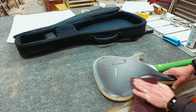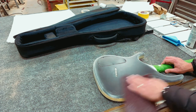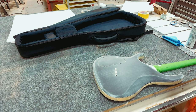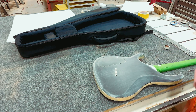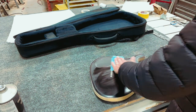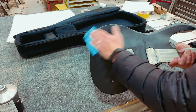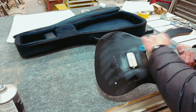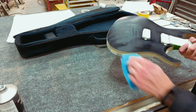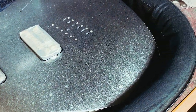I'm just using the red one here to get this abraded. You can use sandpaper as well — I'd opt for around 600 grit before normal painting, 400 or 320 before a typical primer, a little heavier on bare wood. If you're moving to just a thin coat with clear coat, I usually go for around 800 grit. After abrading I move on to cleaning. Part of why I like those scotch pads is they're very flexible and get into areas where sandpaper doesn't do so well.